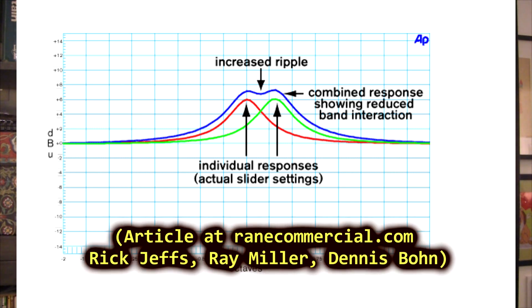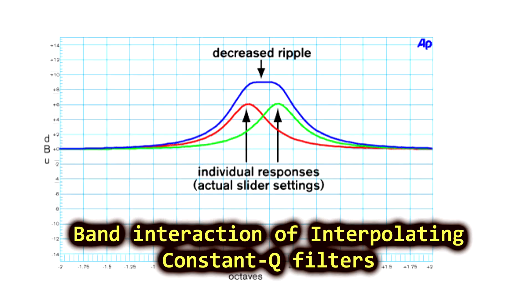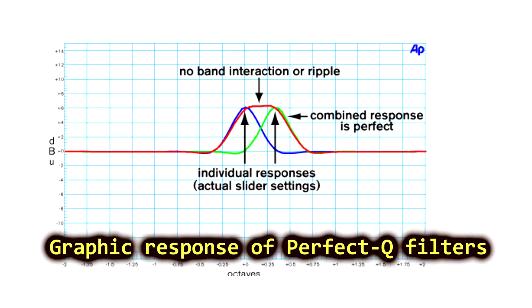Let's talk about ripple for a second. If you took every single slider of an EQ and turned it up 6 dB, there's going to be some amount of ripple by the way they're combining on the output. With the Rane interpolating EQ — however you want to pronounce that — there's little to no ripple on the output. And then there's the Perfect Q system. You don't always know what's in front of you unless you study equalizers and go right into the specs every time you use one. But sometimes you just can't go to the specs and you say, just give me a 31-band EQ please. You can make it work.